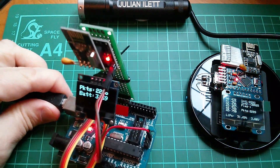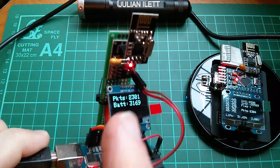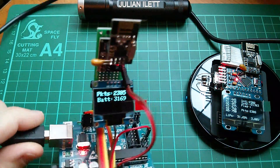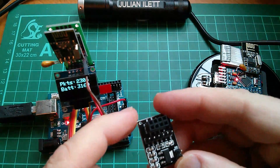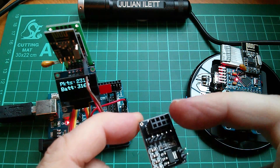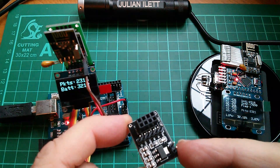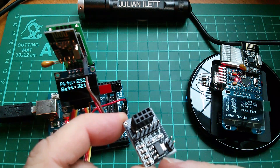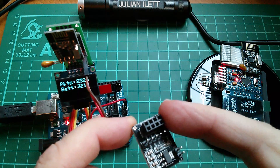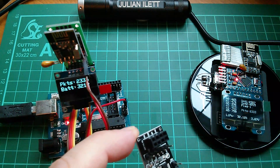I've made a few modifications to this. I've built a nice little transmitter mast with the NRF data transceiver perched on the top. It's plugged into one of these little converter boards, which takes these six lines into an eight-way connector for the transceiver and adds 3.3 volts from a 3.3 volt regulator. So you can put 5 volts in, 3.3 volts comes out, goes to the transceiver, and all the data signals can be 5 volt because the transceiver is 5 volt tolerant.